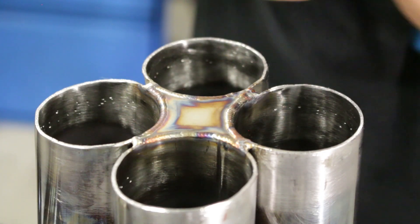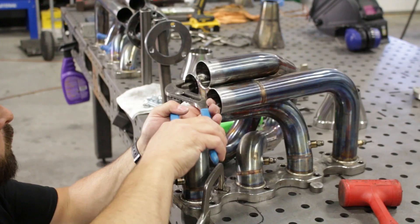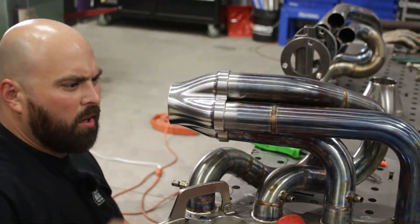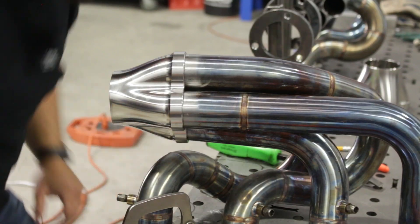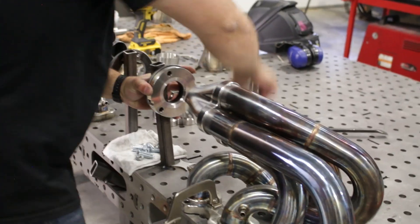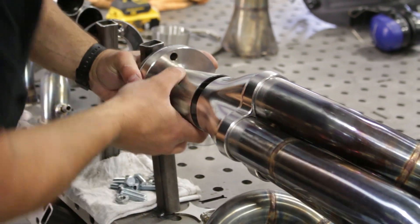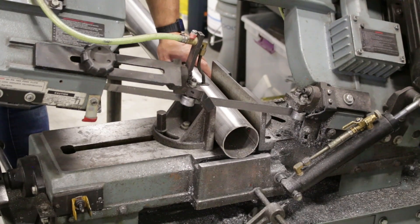It makes sense now but hopefully it makes sense later. What you see me doing here is welding the star into place and it's flush with the end of the tubes — what I really needed to do was recess that star in past the tubes by about a quarter inch. I did this correctly on the second one, don't worry, but I just made it a little bit harder on myself. Oh, it just fits on like butter now — perfection, absolute perfection. Wow, that is straight as hell — that is incredible.